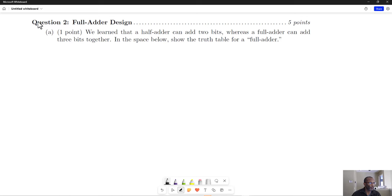Looking at Quiz 10 from fall 2023, question number two asks you to consider the design of a full adder. Let's take a second — if we want to add bits together, we're looking for something that can give us the result from adding two bits. When we're adding two bits, there are occasions where one and one is two, and that gets carried out, producing a carry out.